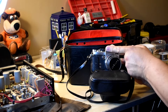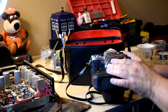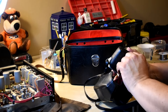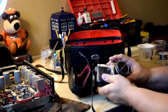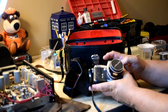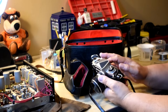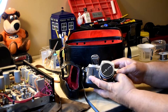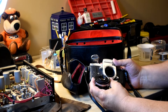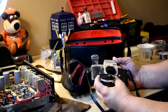The Sensor X had a selenium cell meter up in here. This one is actually a battery-driven meter — it's like a Wheatstone bridge type of meter. I fired the shutter a couple of times. You know what's neat about these? They're really made for serviceability — two screws and you can take the prism off and clean the mirrors inside. It's a bayonet mount lens for 1969, which is kind of interesting, and it does fit the Mirandas.